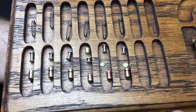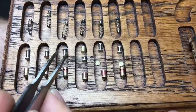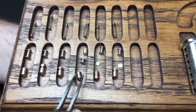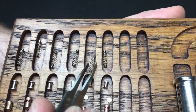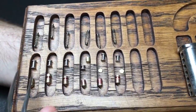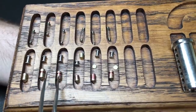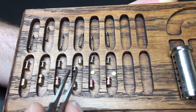My experience of very thin-rimmed, deep steel spools is that they are really, really hard to pick. Usually brass, being a bit weaker, tends to have less deep spooling and slightly thicker edges, and they feel a little softer when you pick them. These feel hard. And these are all steel springs as well, which put a lot of pressure on the pins in a downward force, so you tend to have to use more force on your pick. Using greater force against steel springs, you tend to use higher tension — all of that seems to contribute to making this lock harder to pick.